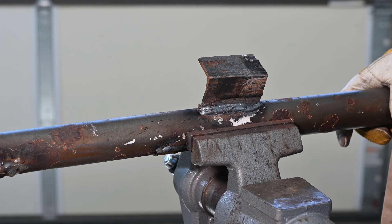A hundred thousand tensile, super high elongation — it's just a super wire and it welds through the crud when you have to. One-sided welds. We have literally hundreds of customers that won't use anything else but this Polaris MIG on their trucks, frames, heavy equipment, and buckets, because they've had welds crack and fail before — not because they weren't welded properly, but because the wire they were using, or a rod like a 7018, just couldn't handle it. And Polaris MIG can. I hope you'll give some of it a shot and I thank you very much for your time.